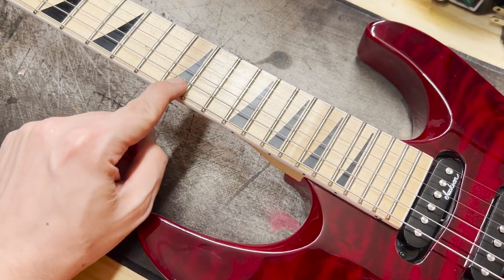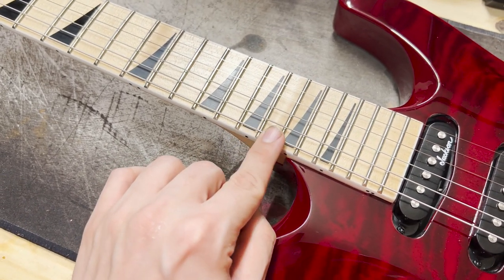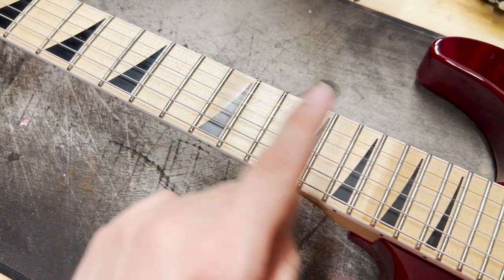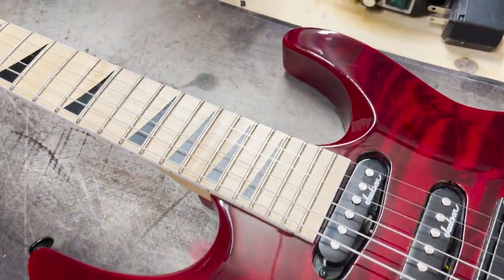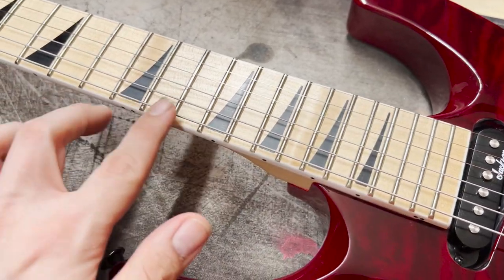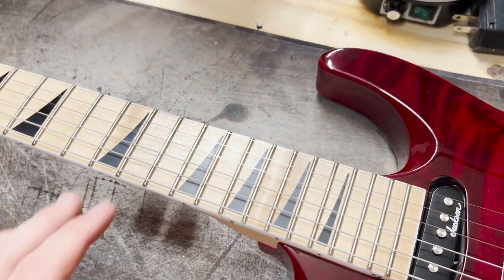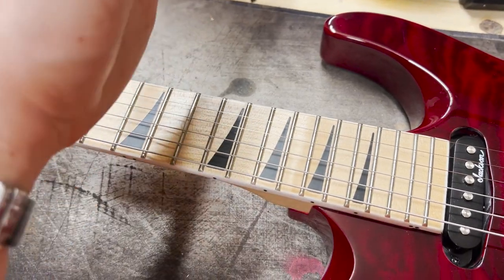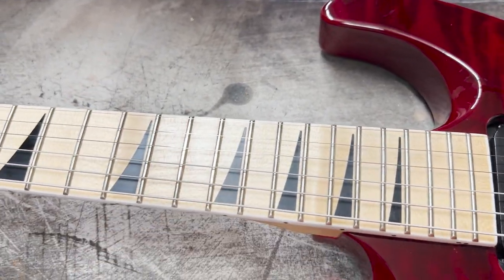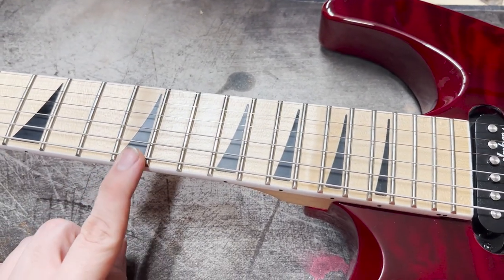I don't know why, but this fret, the 12th fret and up here as well, it looks, I don't want to say chopped in or spliced in or anything like that, but it's very interesting that you have this grain pattern and there's just a straight streak. And then over here, there's some denser fibers. That said, I have seen some cuts of maple where you have these really dense striations that go through with the rest of the smaller patterns. So it's probably just a very fibrous part of the wood, but it's kind of interesting. They usually go up and down, so maybe on this cut of the neck, they cut the blank this way, and so it's running left to right. Again, just one of those things that I pick up as somebody who works with wood on the regular, but it doesn't look bad at all. It's just a little bit different.